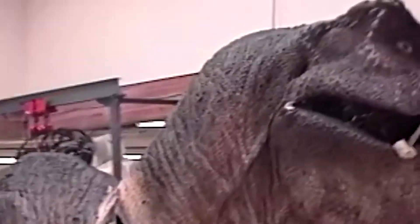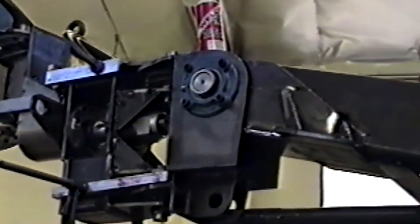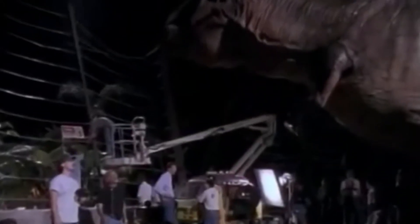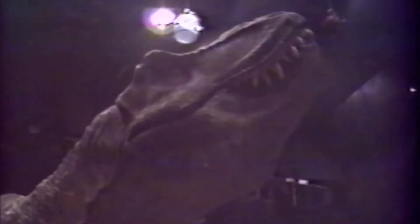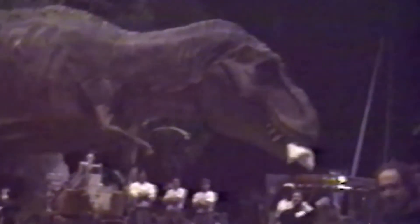Spiral rings were used to build the parts of the frame that allowed for a lot of mobility, such as the neck and tail. The spiral rings, rather than the distinct circular rings used by animatronic builders at the time, did not allow the frame to slide or bunch up in spots, making it more stable. Stan Winston Studios connected the animatronic with an accelerometer to steady gross movement, which could reach 90 inches per second, because Newtonian laws still applied to the character.